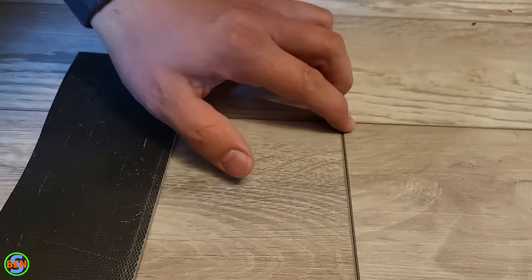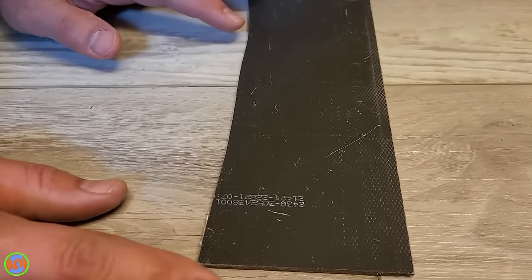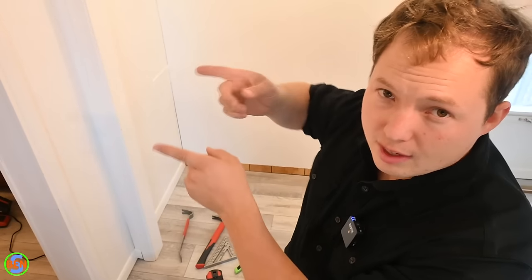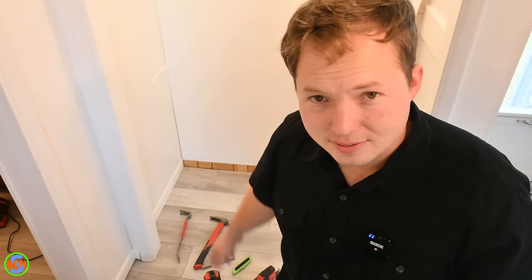The gap did close — that's good. It tightened up over here too. We did cause some permanent damage though; you can see a crease or crack right there. One option is to pry it up, put some super glue down, and press it back. All of that could have been avoided with proper prep. Ole's machete saved the day! If you found this video useful, hit that thumbs up, subscribe, and I'll link related vinyl plank videos on screen. Have a fantastic rest of your week and a very successful vinyl plank installation.